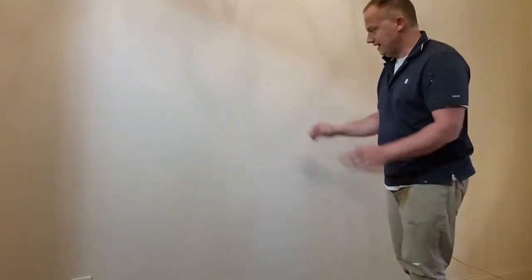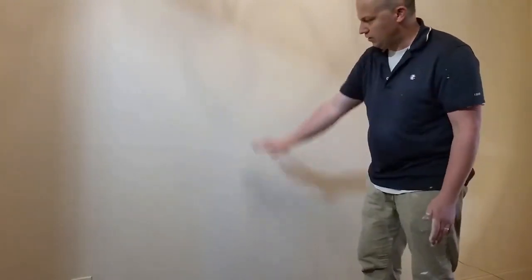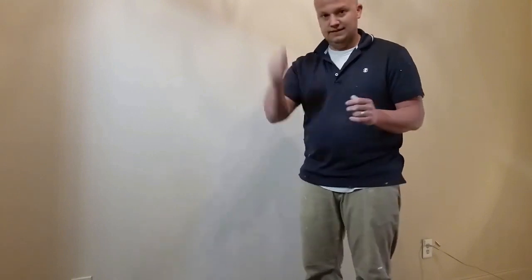Okay guys, thank you for watching our video on how to do touch-up paint. Let's review real quick: when you come into the house, cut a little sample off the wall. Take that sample to Sherwin-Williams or any paint company — I just like Sherwin-Williams — have them do a match for you. Then come back and paint the wall. Don't paint the whole wall, but I do recommend putting the paint lines above the side of your eyesight — that'll help it blend in and create the illusion that the wall has been painted. That's a great way to offer your customers a cheaper paint job: you can do the full paint job for X amount, or a touch-up paint job for less. Or if it's your own home, you probably don't have to paint the whole thing — just do some touch-up paint. For more tips, please subscribe to our channel and we'll see you next time.